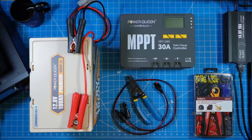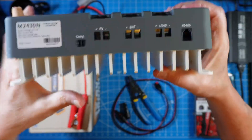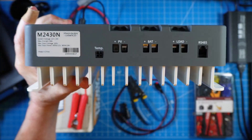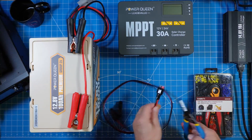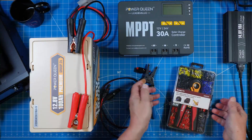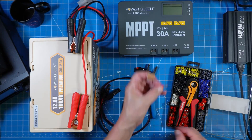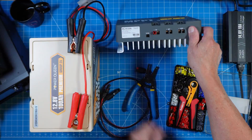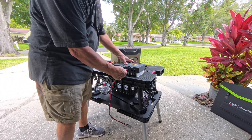Let's talk solar. While I was completing my charge using my 110 AC wall charger, I decided to go ahead and get ready to use the solar charge controller, because once I deplete this battery using my CBA5, I want to charge it up using the solar controller. So I need to custom make a cable — I take a cable I already had, chop the end off, and put some ferrules on the end of it. If you use a ferrule that's too large, when you crimp down on it the ends just get deformed, so you want something that's really tight when you first put it on. Then you can stick these wires with the ferrule attached into the appropriate slot on the charge controller and torque down on it, which works better than just using bare stranded wires.